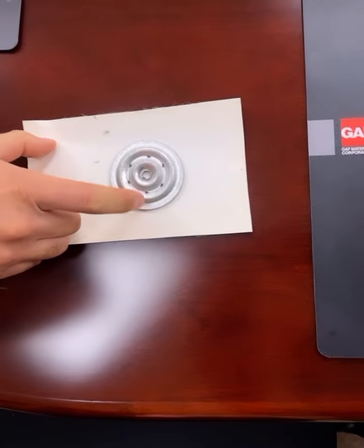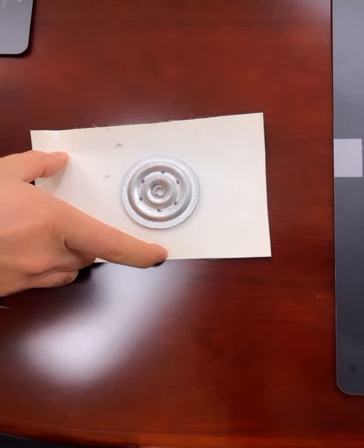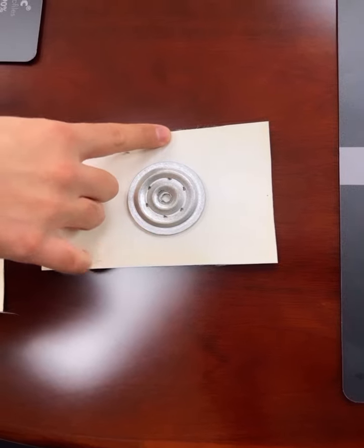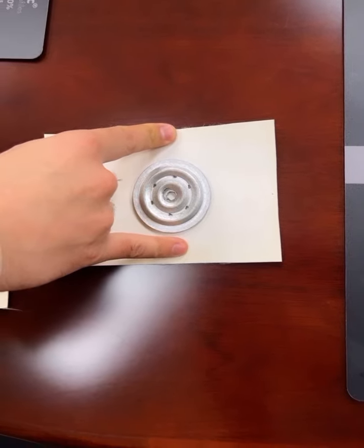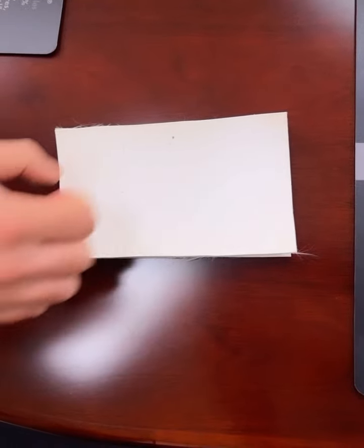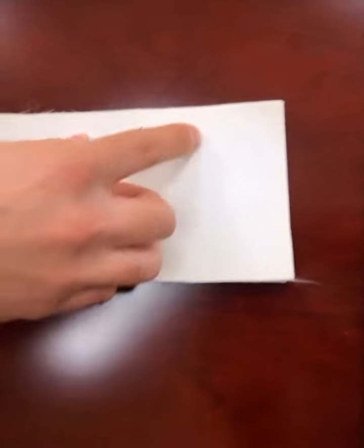Hey Chris, can you explain that? So your plates are supposed to be between a quarter and three quarters of an inch off the edge. But they also have to have enough space on the opposite side so that you can get two good welds on both sides of the seam. Once your material goes over top of that plate, if you don't have enough space to weld down the seam, you can create cold welds.